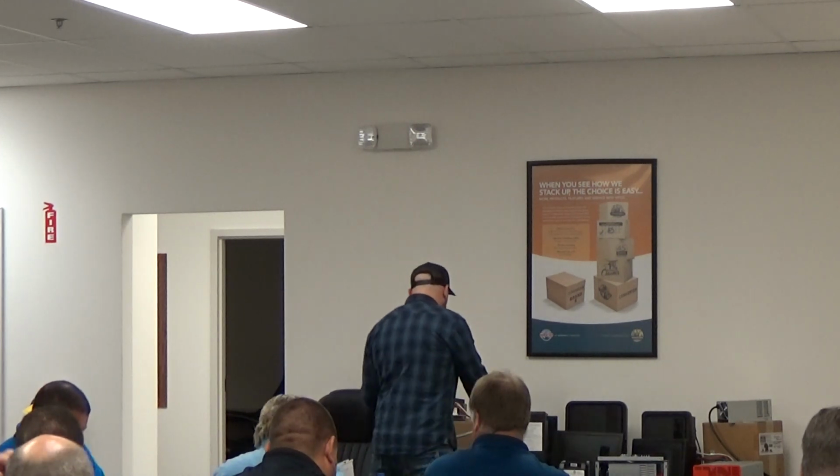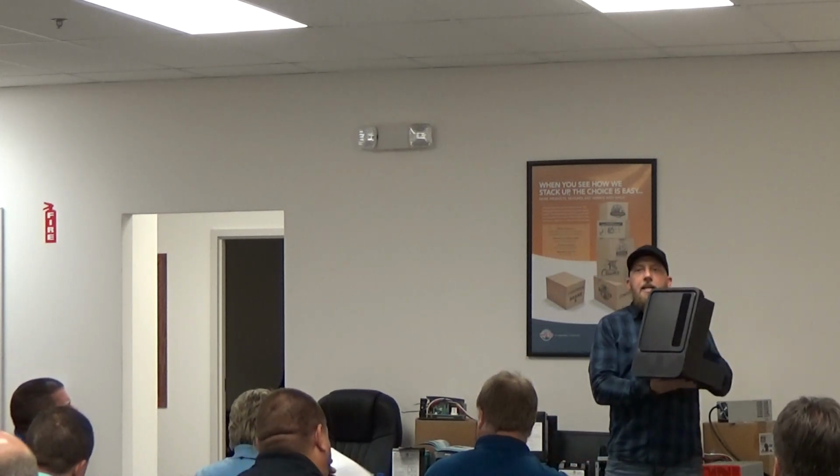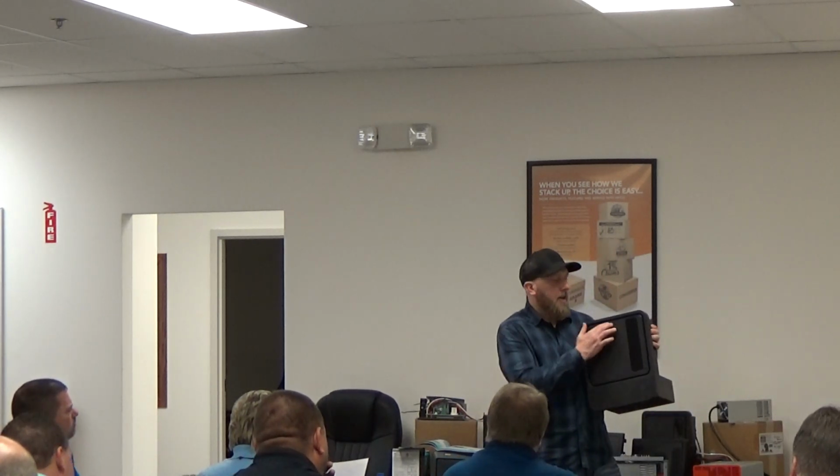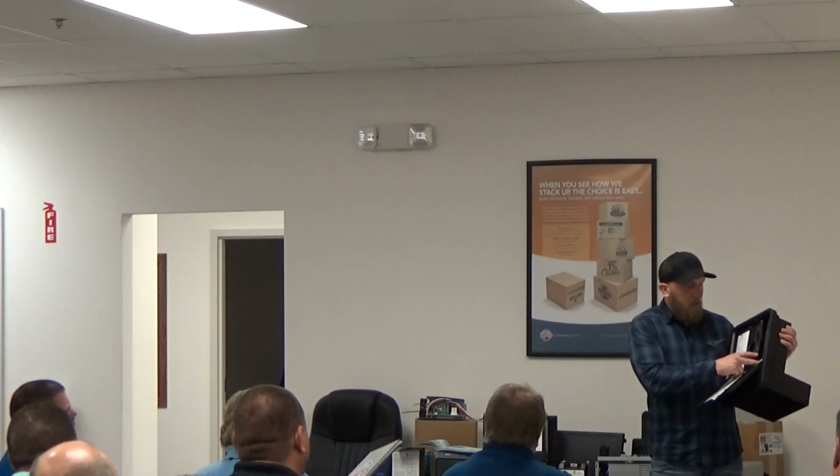You go to page 18. Now we're getting into our other new product, which is just like the 8500, but this is the 9500. It's the exact same thing, but this is for 50 amp service. So this is our 50 amp panel compared to the 8500. It's just a 30 amp panel. So you have two 50 amp breakers, but you have the LED indicator for incoming voltage again, and the same thing on the DC fuse board. You have the blown fuse indicators, but you also have a bulk mode indicator on the fuse board as well.